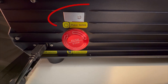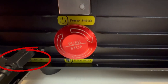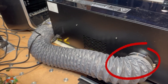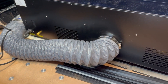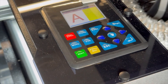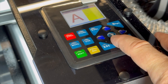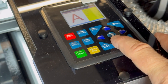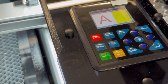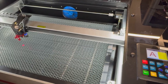On the right side of the machine, it has the on/off switch, the emergency stop, and the connection for your computer. The back of the machine has the power cord attachment, the 4-inch diameter exhaust port, and the water inlet and outlet. The Reno 65W Pro includes a DSP controller with a 2.4-inch LCD display screen that allows you to move the laser head around, has a frame function, and you can set your origin. You can also connect the laser to your Wi-Fi and load files using the USB port.